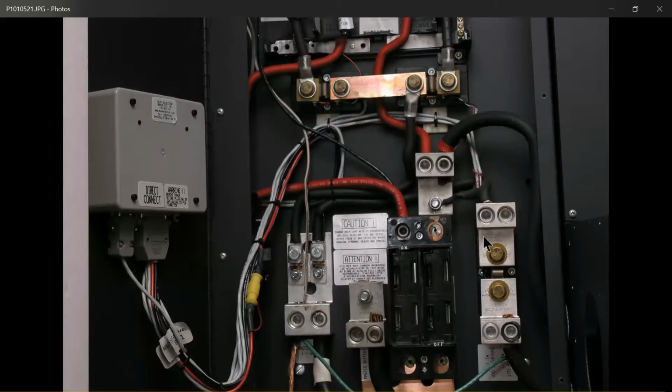And the Whiz-Bang Junior comes with some spacers and things to bolt that Whiz-Bang monitoring board onto the side of that shunt. I think you'll be able to figure out how that goes on there. You could consider then slipping the existing Omnimeter connections to that same connection point to continue monitoring that shunt on the Omnimeter.